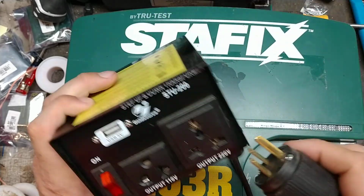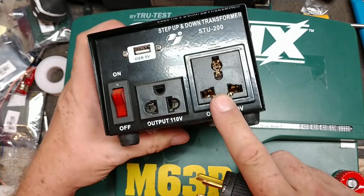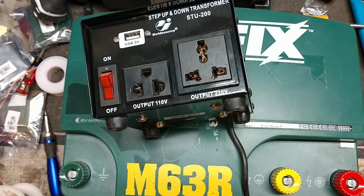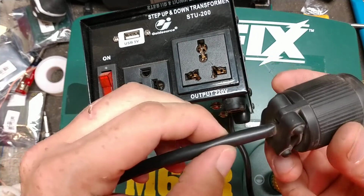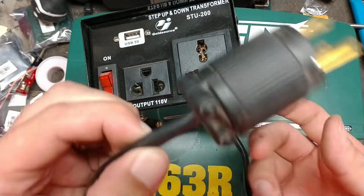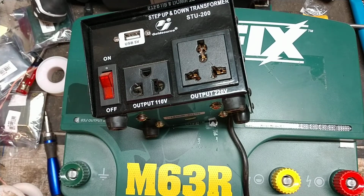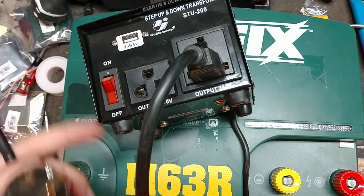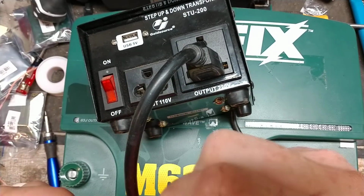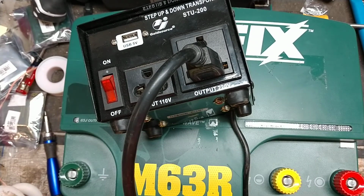just like that, hopefully. Oh no, we're not. We're going to have to use my adapter. Let me show you what I got, because this is actually a three-prong plug, but it's only a two-conductor cord, so there's a ground on there for no reason. But that's what the customer decided to put on there. What we're going to do is take this 110 volt cord and plug it in like that. I've got a couple of alligator clips. I'm just going to clip it on here to each side, the hot and neutral, or whatever they call them on 220 volt.